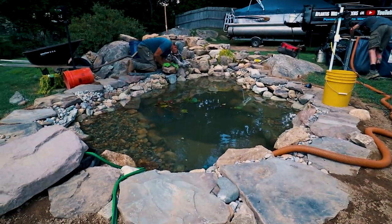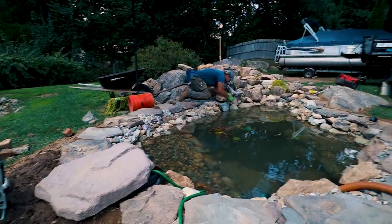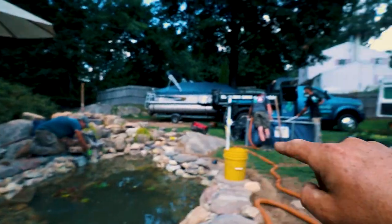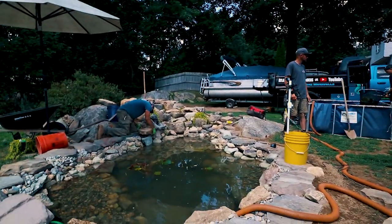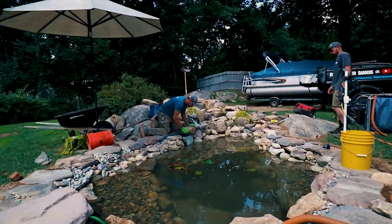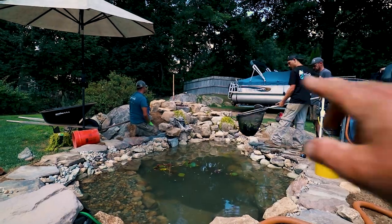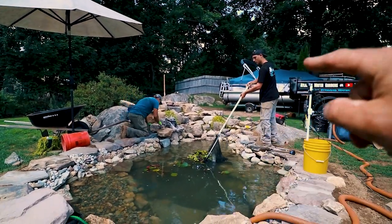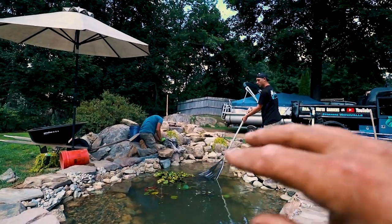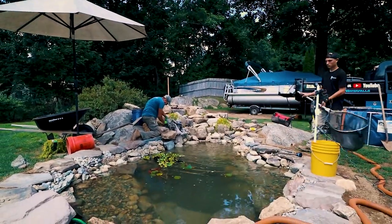Most of the waterfall is complete. We're still buttoning up a couple of our edges and the wall behind our biofalls. We've actually even started pumping water back from our holding tank and refilling with fresh water to pick up the difference. You can see our pond is almost full — probably another couple inches to get to the proper water height. The waterfall is at the far edge, Bully's still doing some edge work there. These guys are catching the fish we took out from the existing pond. It's quite a transformation just simply by rearranging the rocks up in that waterfall. A lot of the rocks were already here — we brought in some more, but most were what were used in the waterfall already. Just repositioning, spinning, and flipping can really transform any waterfall.